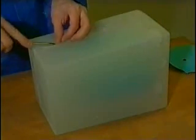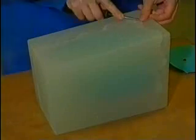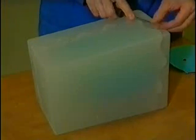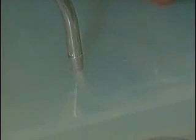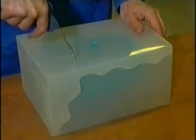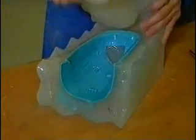For a quicker hardening of the resins, the mold can be tempered at approximately 70 degrees Celsius so that the parts can be taken out after 15 to 30 minutes, depending on the respective resin. A shot of pressurized air facilitates the parting of the mold and removal of the part. Kneading and bending the silicone mold assists part removal.